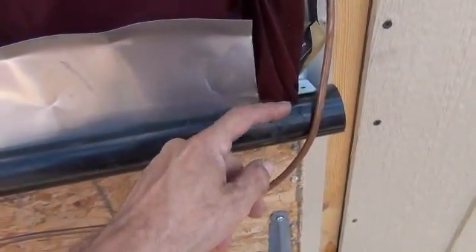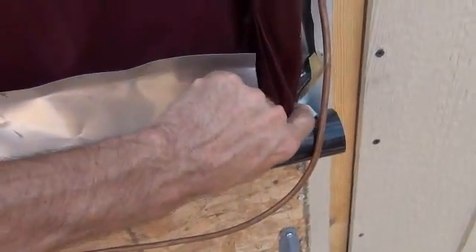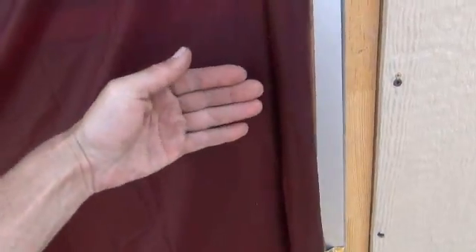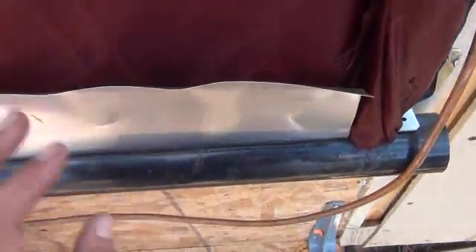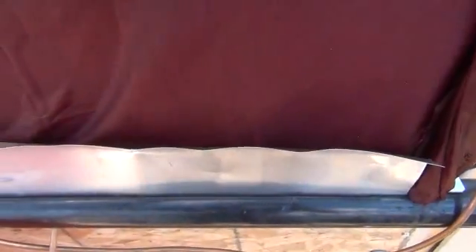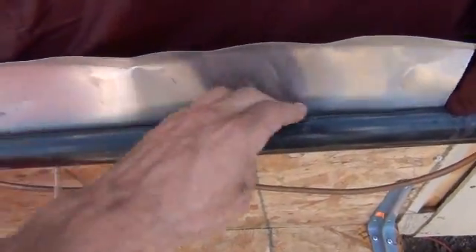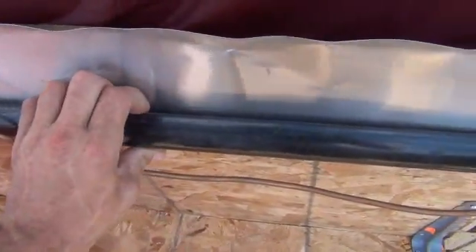Here I hole-sawed in a piece for a 1 inch piece of PVC pipe — actually it's 3/4 inch PVC. Can't tell, it's underneath all the cloth here. In the end it actually goes inside of that. What we have here is all the water that runs down the cloth is going to go behind this piece of flashing. The flashing is also recessed in this miter groove in the PVC.